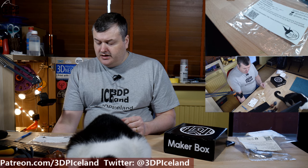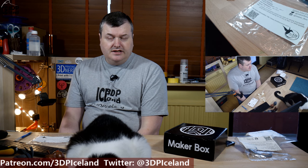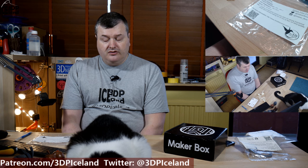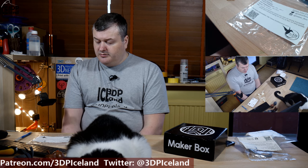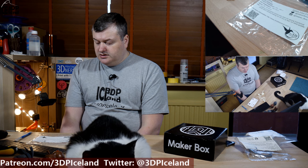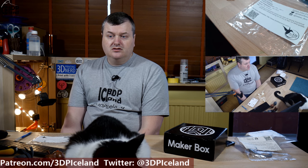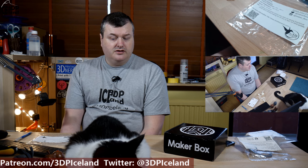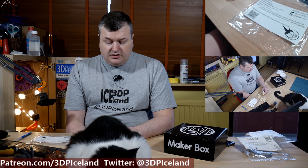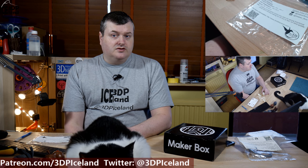So this was the ABS-PA or polyamide nylon blend from Dr. 3D filaments. This filament came out excellent — I was quite happy with it and it was very easy to print. I printed at 260°C on the hotend and 100°C on the bed, at around 45mm/s as suggested on the label. I was using a glue stick on the PEI sheet on my Prusa MK3 printer, and had quite good results with that bed adhesion method. I hope you enjoyed this video — thank you for watching.